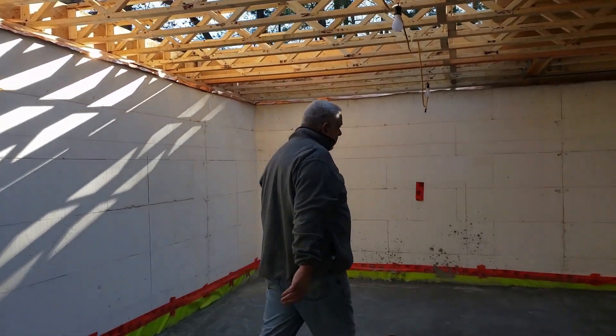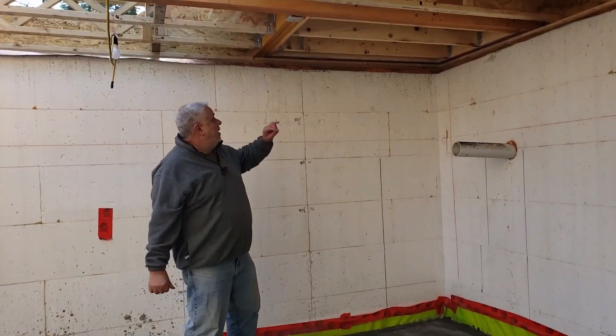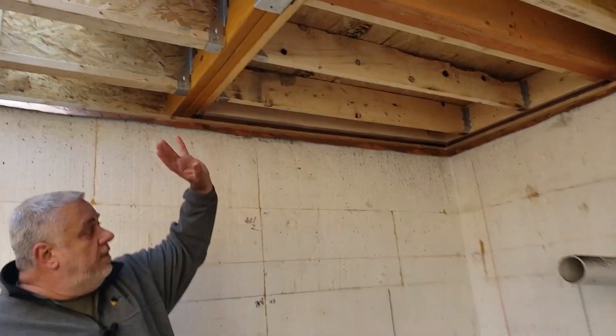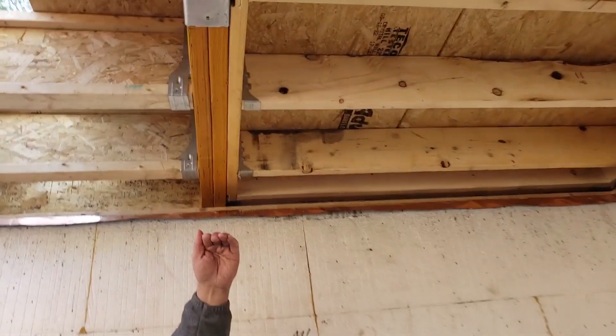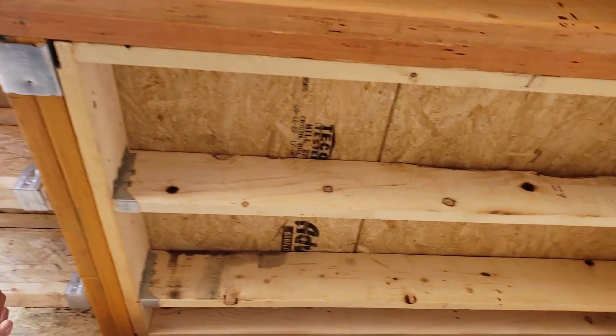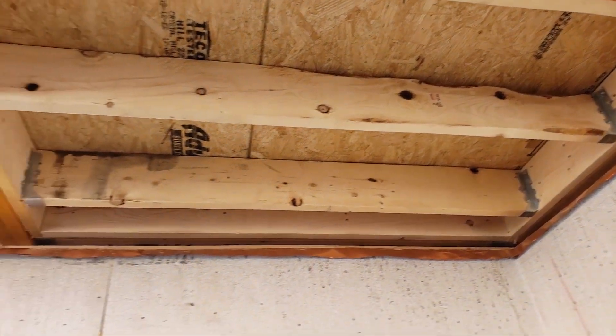One last thing we can see over here — you saw it in one of our other videos — this is basically the bottom framing of that shower pan. We have a curbless shower there. We frame it out like you were framing out an opening with the LVLs, and then it gets infilled with a two by eight frame.